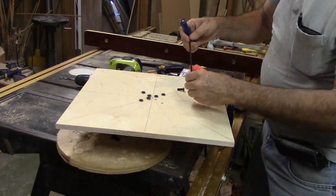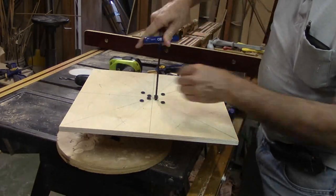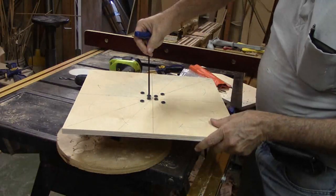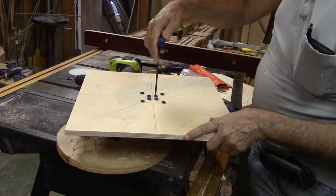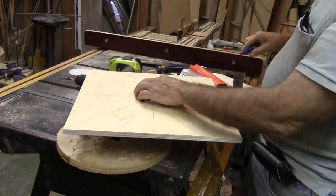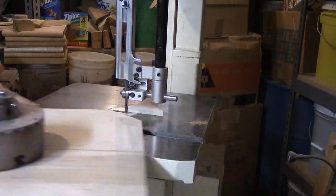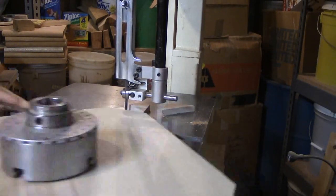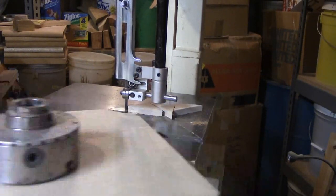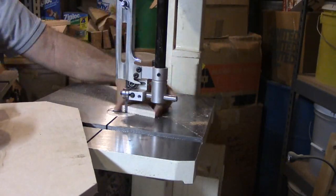While I could have marked concentric circles with a protractor, I wanted to use the lathe to ensure they would be centered on the lathe's center. So I mounted the plywood onto the chuck. And of course the plywood would not fit my lathe. The plywood corners prevented the plywood from rotating. Since I still did not want to round off the plywood, I cut off just enough of the corners to allow the plywood to rotate on the lathe.